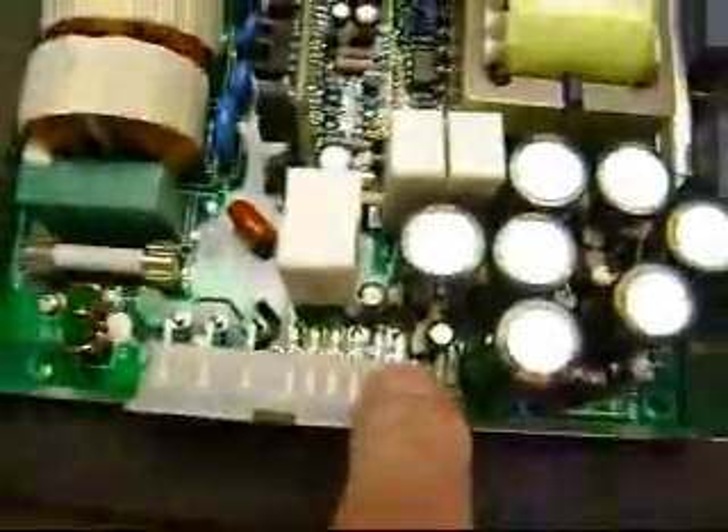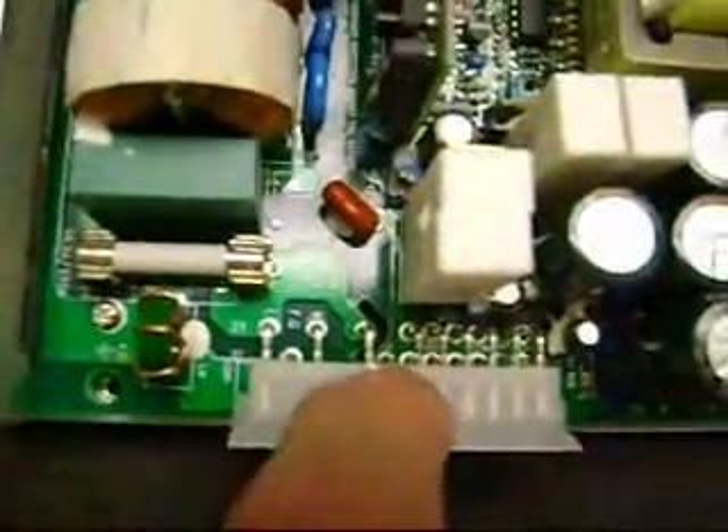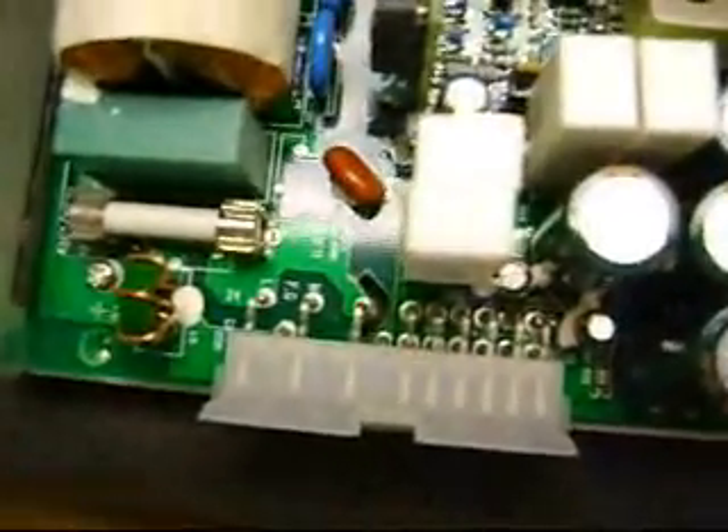There is another output from this power supply. There are three outputs: there's a 13-volt output, clearly labeled here; there's a 25-volt output; and there's ground. But at pin 7, there is yet another output — it's an output that kind of tells the computer that the AC power is okay. I don't have the schematic for this power supply, and Wintact won't give it to me.